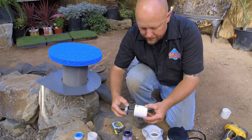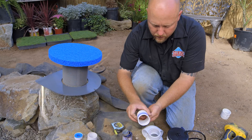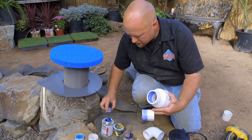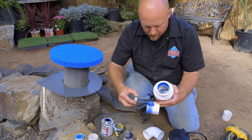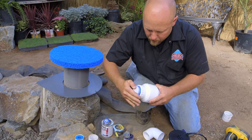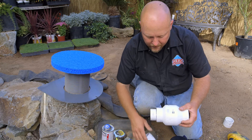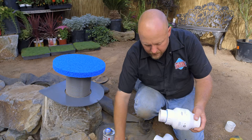My pet peeve when it comes to gluing is I really don't like having glue spilled all over the place. I just don't like seeing a check valve with glue and primer all over it. So I do a nice clean primer — I'm kind of tilting it so I don't have anything on the outside. When I put them together, you apply pressure, give a twist, and hold it in there. On these really tight connections, you want to make sure you hold it so it doesn't back out at all, because if it backs out a little bit it'll definitely increase the size of your fitting.